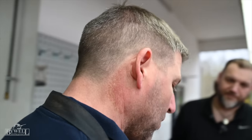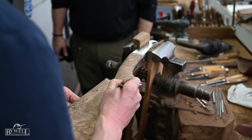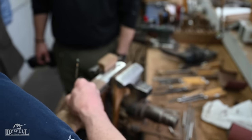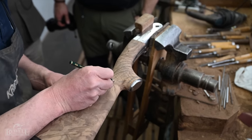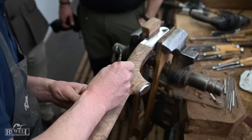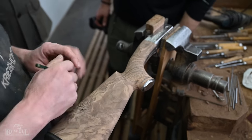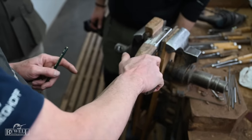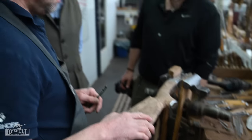And then we did the drawing normal. We cut a normal right hand. Did a little box in here where the thumb ball is, so that you have a little more checkering in that area. So if you grab the gun and you have the thumb ball, you get an extra grip. An extra grip there. And you do the checkering yourself as well, it's not a separate process.